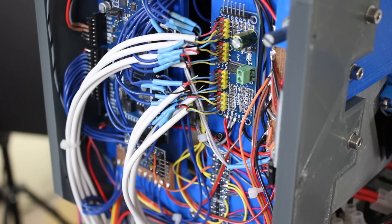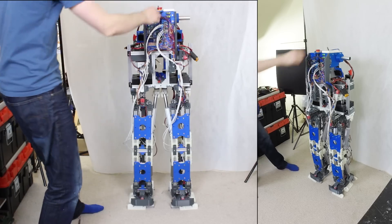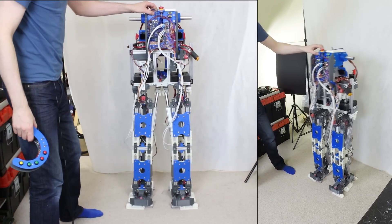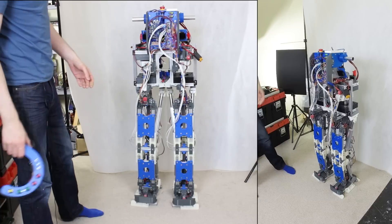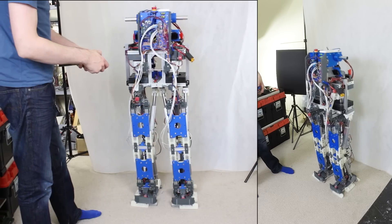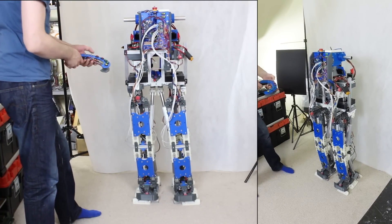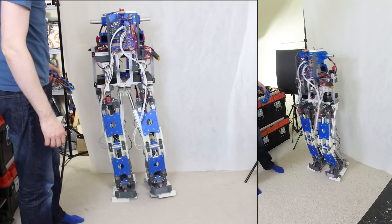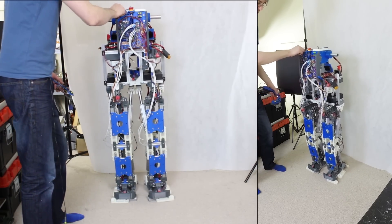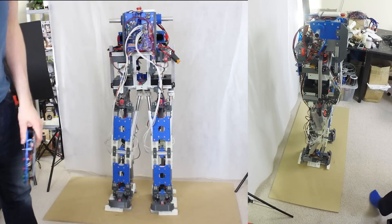It's a pretty nasty solution but it does actually work. So it's all wired in and now we're going to switch it on. I haven't made any code modifications yet and we're going to see what it does. Those actuators are quite a lot quicker than the last ones so I need to turn it down a bit — it's a bit jittery, but it feels a lot more solid. Let's see what happens if I turn on the walking algorithm from before. That looks pretty good to me. All I've done is turn down the gain on my controller and it's on a smooth surface now, and it seems to work much better.